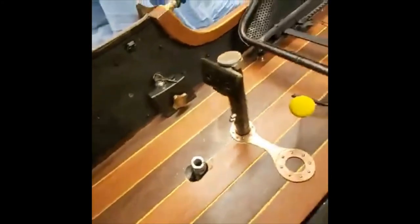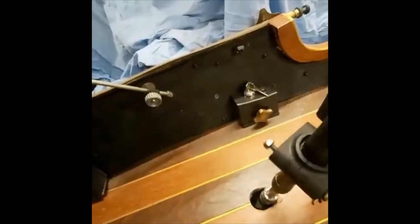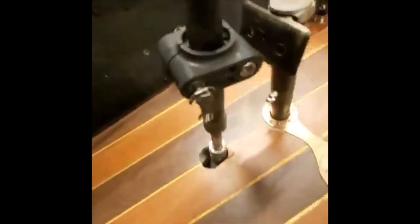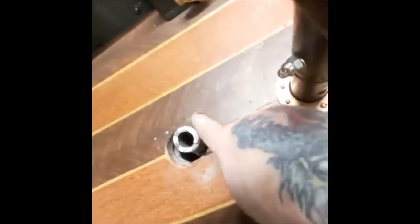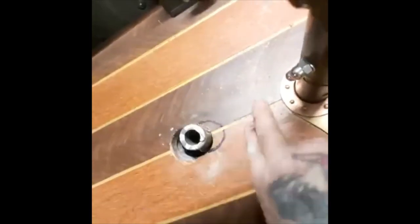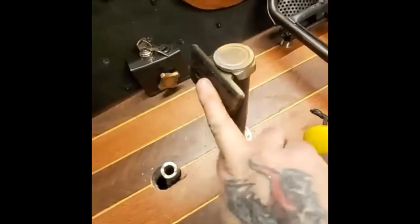There's the knuckle coming up through the floor — I have the rack now roughly positioned underneath where I want it and it's working fine. This is my steering column, and it basically goes down in here. The problem I'm faced with is there's about three or four inches of difference, so where you see the blue mark on the floor, I must take that much out to allow this knuckle to move back and give me the angle I want.